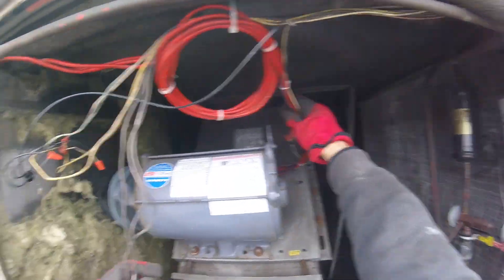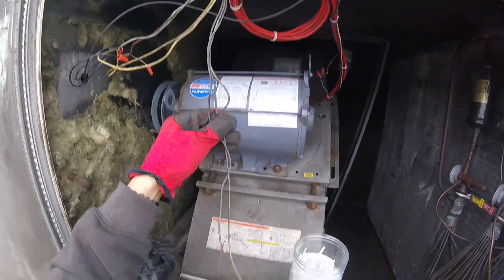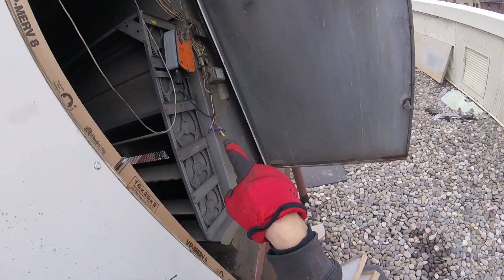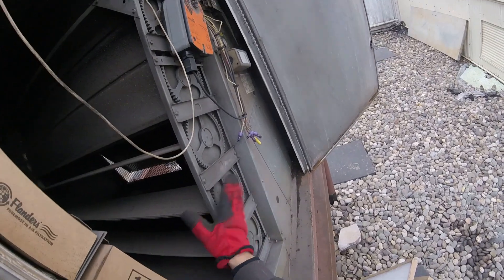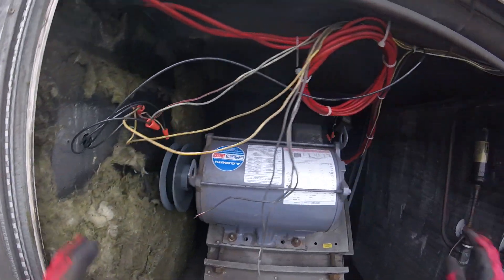This is now wired. My fan motor is wired — I matched up whatever colors I could. There's just three black wires but I don't know where they go. They go somewhere down here. Open up this damper, which is already open. If you look inside here, that limit switch — it says auxiliary limit switch one — it's disconnected. So we're not going to get heat here.